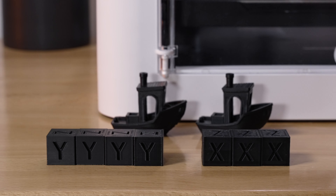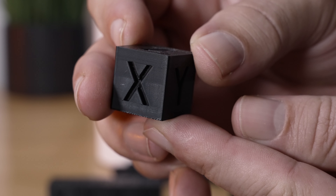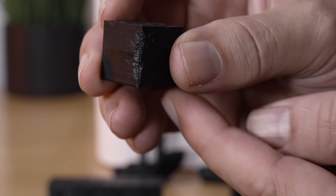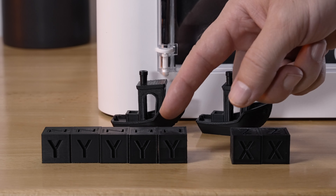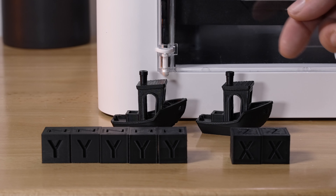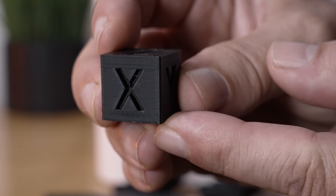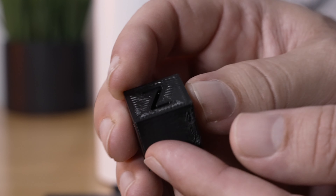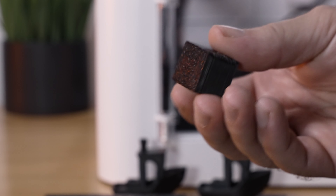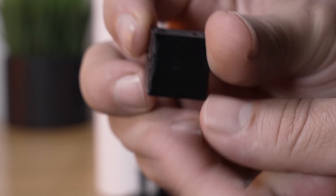Time savings are getting really minimal now. At 300mm/s the cube still looks reasonable, but the corner is pretty rough — I didn't optimize the settings, just went with whatever — and that took seven and a half minutes. At 400mm/s the walls are staying clean, nothing too weird, though the corners are messed up, possibly a slicing error. That took seven minutes. At 500mm/s it looks pretty much the same as the 400 and also took about seven minutes.